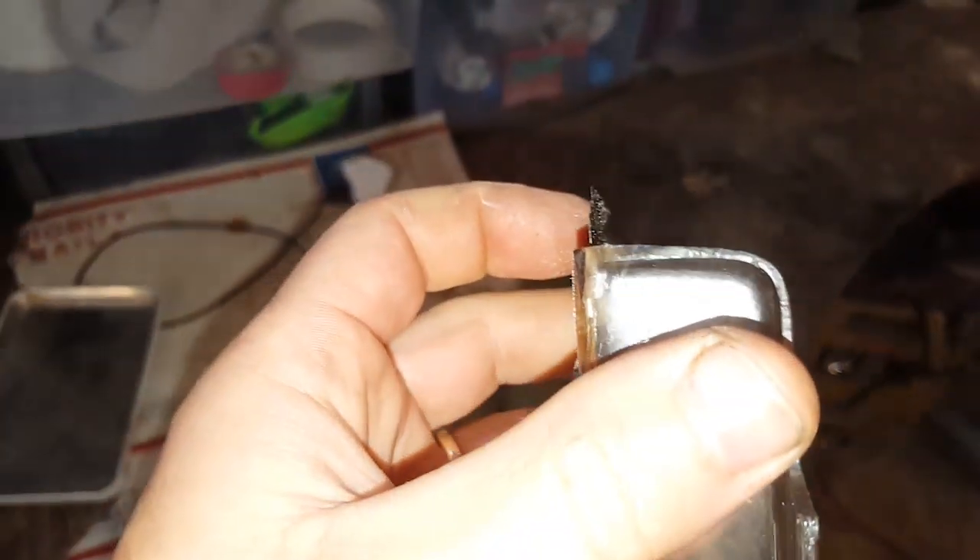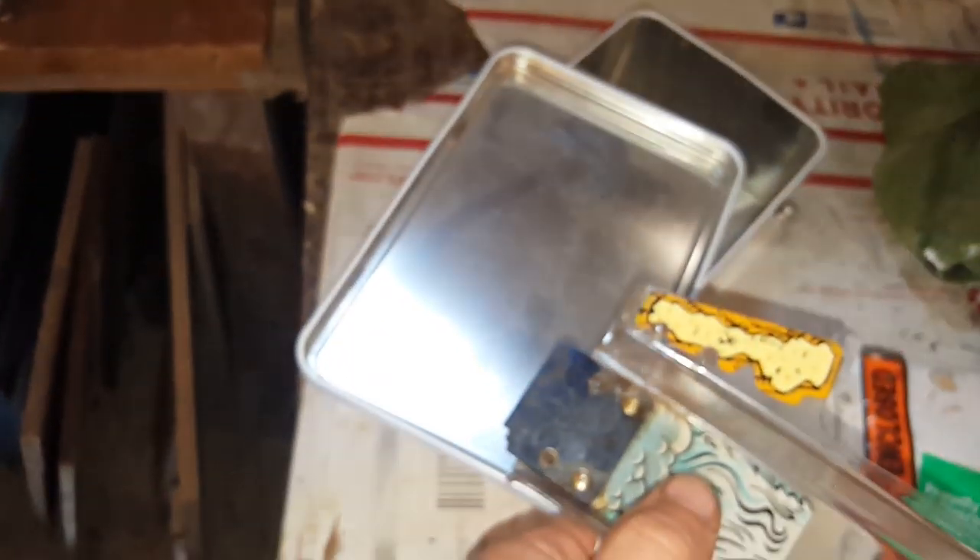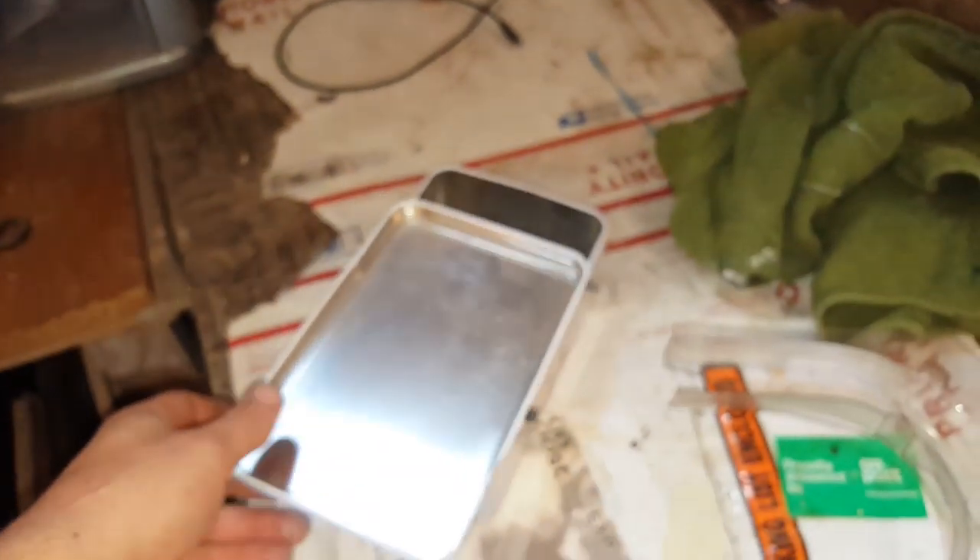Some very nice folks pointed out where I can buy them, but most suppliers are in the US so I'd get hit hard on import costs and shipping. I think I can replicate the flaps myself. I'm going to use a biscuit tin — it's roughly the same gauge metal. By the time I strip it of the external paint and sand it to clean it, then gun blue it, I can use this flat section here because it's the flattest part and I'm pretty sure I can make new ones out of it.